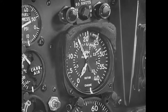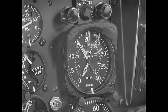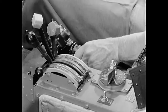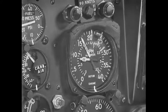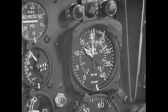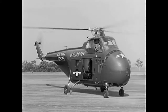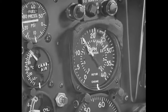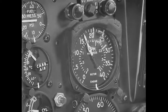After completing your starting procedures, increase engine RPM to 1700 and turn on the clutch pump switch. As the clutch starts to engage, engine RPM will fall and the rotor will start turning. Advance the throttle and raise engine RPM to between 1800 and 2000. Hold it there while the rotor continues to engage. When rotor RPM has risen to approximately 130, reduce throttle until the engine needle falls slightly below the rotor needle — mechanical coupling will engage at this point. To complete the coupling, increase engine RPM until the needles join. Turn off the clutch pump switch and maintain engine RPM at 1700 for two minutes, giving enough time for the oil to drain from the clutch.